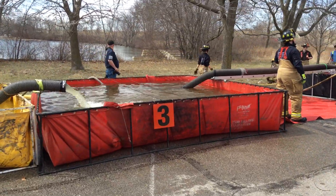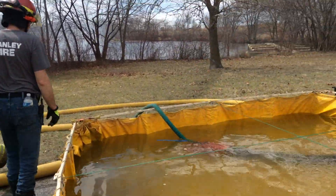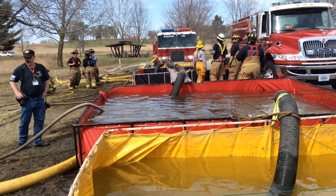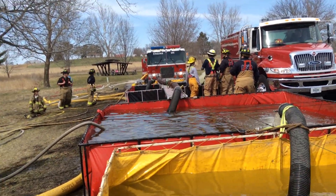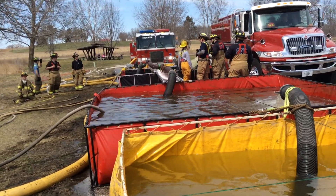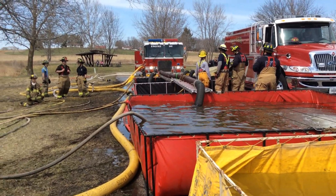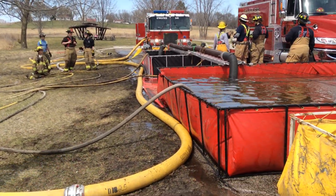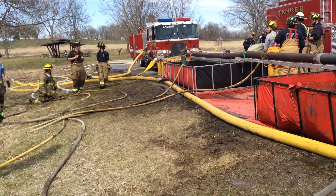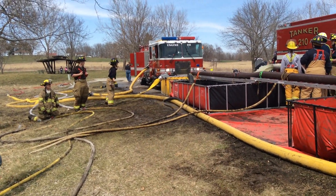We're running four jet siphons. We'll come over here and take a look at the setup. You can see they got a second suction in — dual suction coming off of engine 141, which is a 1250 pumper. We don't know what that flow increase is, but we'd certainly expect that to take us to 1500 easily, probably a little bit more. And of course that single pumper is running all these jet siphons. You can see he has the second suction elbow in.